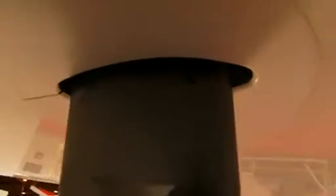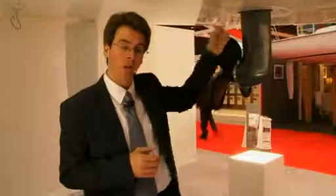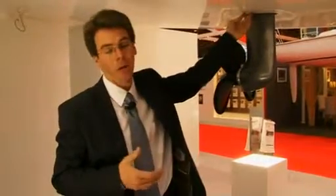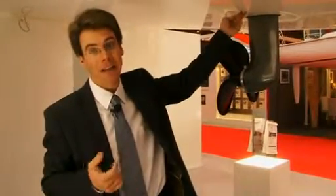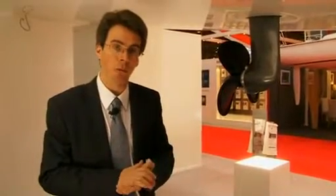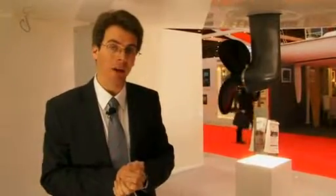Between the interior and exterior of the boat, where we come through the hull, there is a double seal. That double seal has an alarm between the two seals, so if there were any breaching of the first seal, you would be alerted to that problem. It is something that we have been mounting for over ten years — sail drive technology — and there are almost no problems with this type of installation. The double seal with the alarm is really the best available on the market.